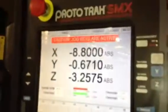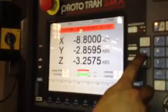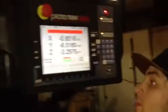He's moving the saddle — let me show it on the screen. The servos and the ball screws sound very good. That's the Y rapid. And that's the X. I'm going to show you on the control. The hand wheel — the X hand wheel — it's a pulse generator as he's doing it there, moving up here. So those are the three axes.